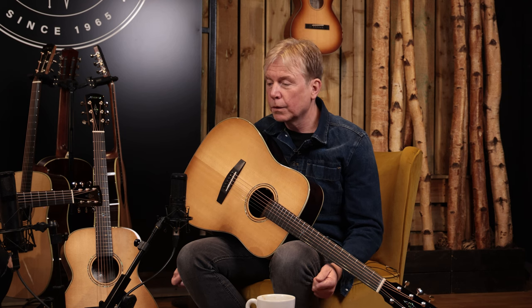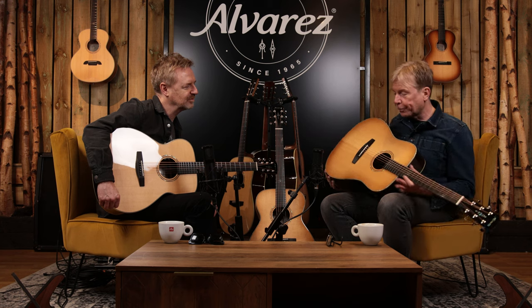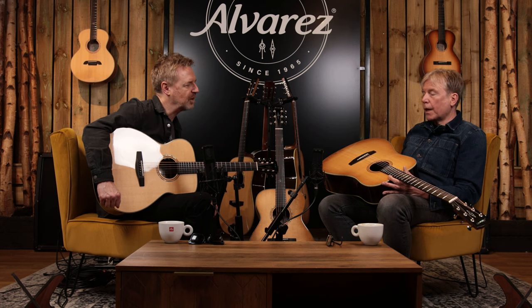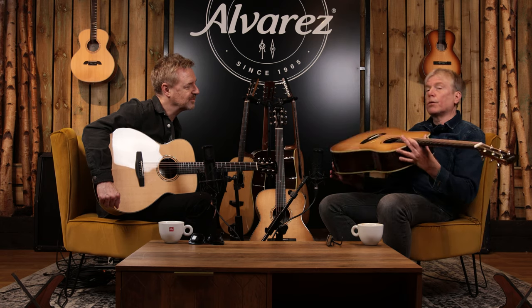So hand selected, what it means is you're choosing the best pieces of material you can for the build. And we've really done this with Laureate in quite a deep way. First of all, the tops are the best tops that come through our world. All of our Sitka is North American, usually Canadian, or from Alaska, and we choose the best ones. We choose the most tight, quartered, silky tops we can find, and that's for sound and response. When they're so on the quarter, we can thickness sand them a little thinner. That's a big start.